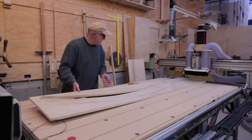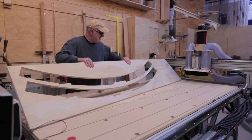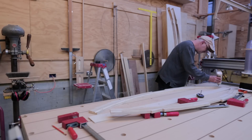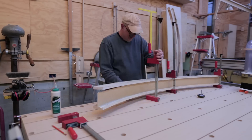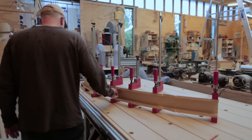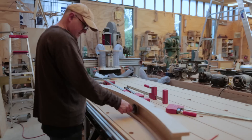I used a quarter-inch compression bit to cut these so the top and bottom edges are really nice, but there's a little bit of fuzz on the actual cut. I can sand that off really quickly, then glue the top, bottom, and middle pieces together — it's a curved dado I'm using, and that'll make a curved beam. The next day I took all the clamps off and the wheel rolls in there nicely.